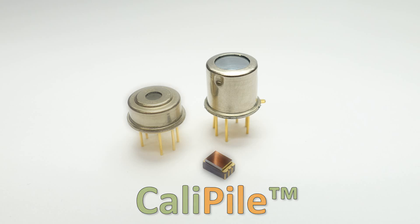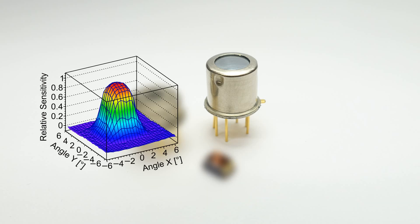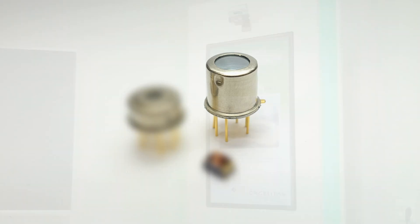When using only a single pixel sensor with a lens, the field of view is only 5 degrees and provides a distance-to-spot ratio of about 10, which means that at a distance of 1 meter you have a spot size of about 10 centimeters.